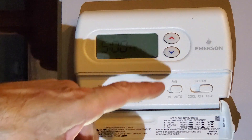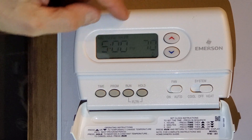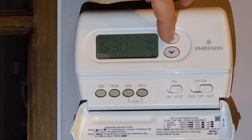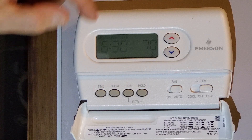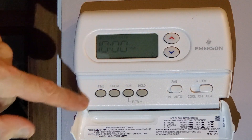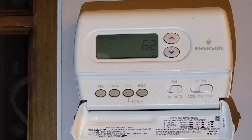I don't need it at 70 — let's make it 70 actually, and we'll start at 6:30 p.m. Let's go to the next setting. Now at night, what time do I want it to drop down? I'll let it drop to 62 degrees, but I won't do that until 11:45 p.m.